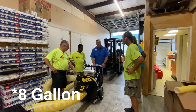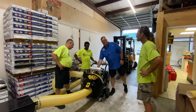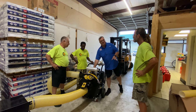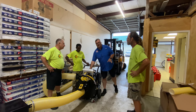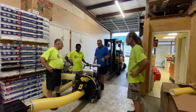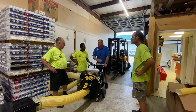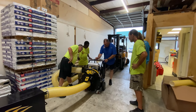This machine has a five-gallon gas tank — it takes unleaded gasoline and also 5W30 synthetic oil. Now if you're down in the south, you probably just want to run 30W straight because of the heat. We put 5W30 on there because some of us come from a frozen climate and need the lighter oil. As long as it's 30 weight — 10W30 is fine too.